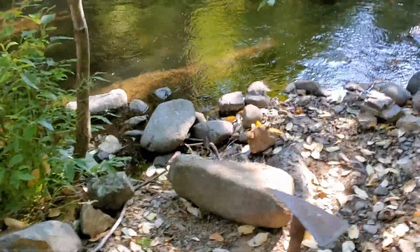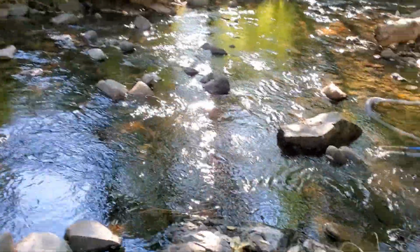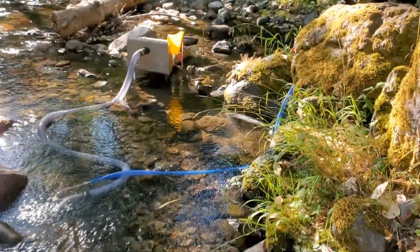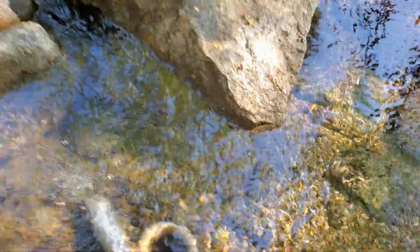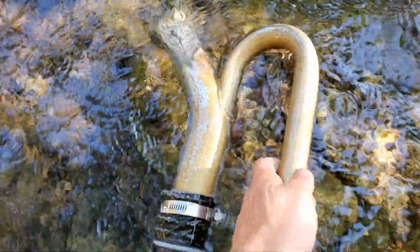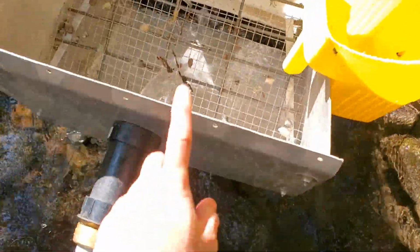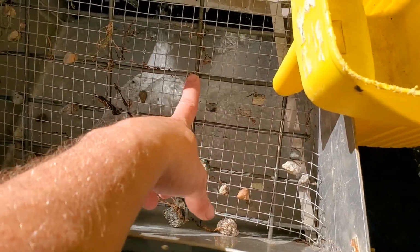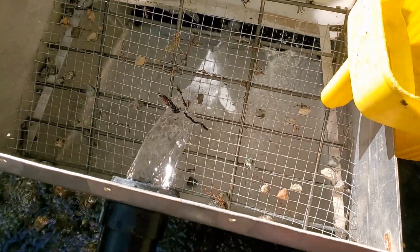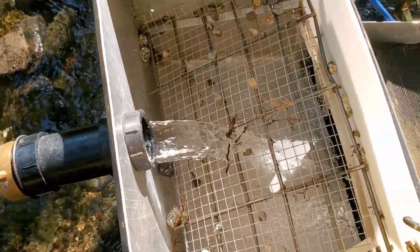Alright, got all the equipment set up, letting our motor idle before we get going and moving rocks. Let's talk about the equipment if you haven't seen it already, and talk about where we're going to dredge and why we're going to dredge there. Alright, nothing too big, special fancy. 2-inch dredge nozzle, 2-inch hose, up to our hopper box. Same one we use for high bank and multi-sluice and everything. We do put a 1/4-inch screen in there to help break any clay or rocks. Gives me a chance to look, see if there's anything nice and shiny, any petrified wood, gems, crystals, such things.